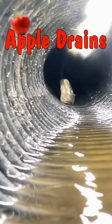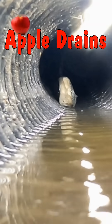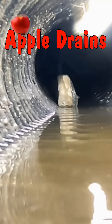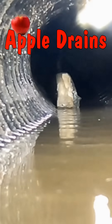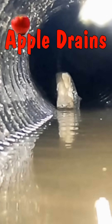During a rainfall event, water rises in your trench and it comes through at the bottom of the pipe. That's why there's a base of gravel underneath. As the groundwater rises, it comes through the voids of the gravel, floods up into the pipe, and the pipe carries this away. This is called a French drain.